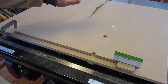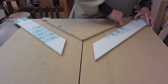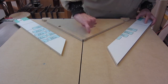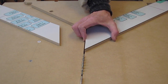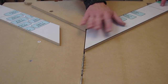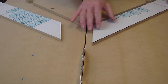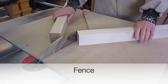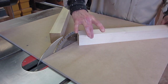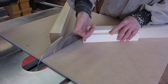When the results are satisfactory, the triangle is glued in place with the spacer still there, and then the spacer can be removed. A few things to watch for when making these cuts: you don't want any dust on here because you want that to fit perfectly. Another thing that can happen is the saw blade hitting the material will push it down very slightly — even a couple thousandths of an inch — and you may not notice that, and then that throws off your cut. One thing that helps is having the blade a little higher so it's coming down more. Also make sure the surface is not slippery. The important thing about the fence pieces is that the sides be perfectly parallel and that the corners be 90 degrees, so that when cutting a piece of wood in this position the blade comes up perfectly vertical.